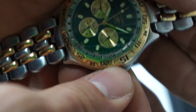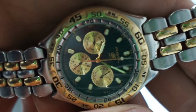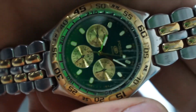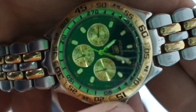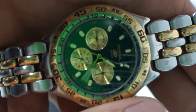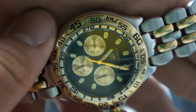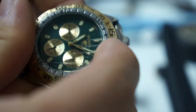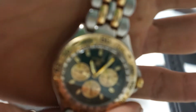That's what it is. Okay, so anyway, the way to set the date there, as you see, just turn the crown at one stop, and then you can test the 24-hour counter if it's moving there while you're moving the hands, and you can test the day the same way. Also test the rotating bezel. I also like to align these right at 60, which is the center point, and that one's ready to go.